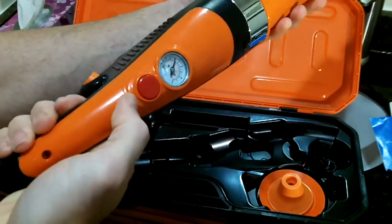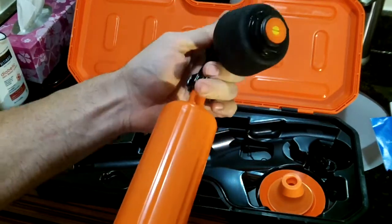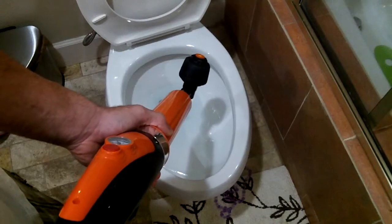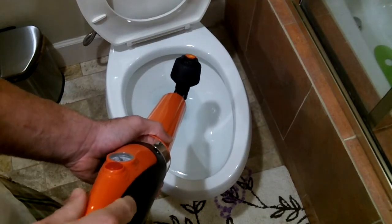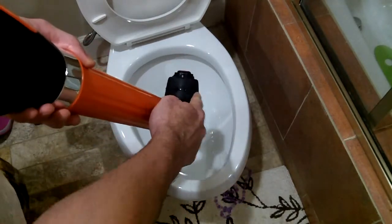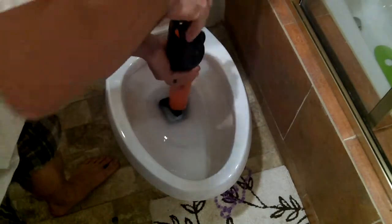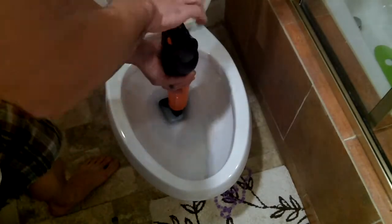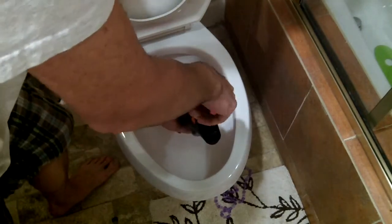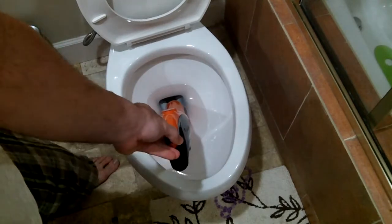The button here lets all the air out, and then you have your angling piece here that will go into the toilet. So now I've got the plunger and we're ready to put it into the toilet. What you do is take this piece down here and put it in the back hole. Then it says to give it a 45-degree angle as best as you can while pushing this all the way forward — so it's going to look a lot like this.